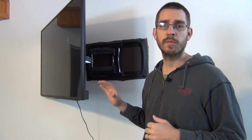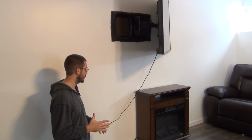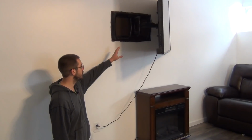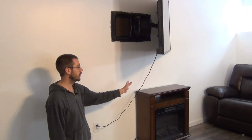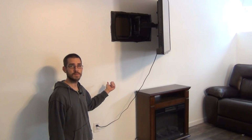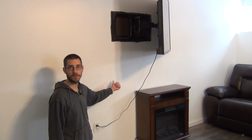I'll show you some of the ways to start planning and preparing before you get started, in order to find where your electrical source is going to come from. A couple decisions you're going to need to make first. Generally you're going to pull power from an outlet. If you have an outlet directly below where your TV is mounted on the wall, that makes things very easy. But generally your outlet might be one or two stud cavities over from your TV mount, in either direction. You also want to look at what's on the other side of the wall. If you have a bedroom on the other side, see if there's an outlet in the stud cavity directly under your TV on that side. You could also pull power that way.